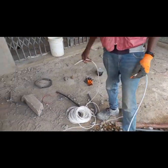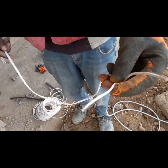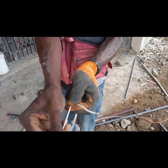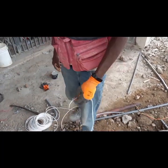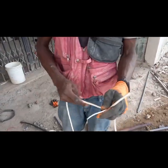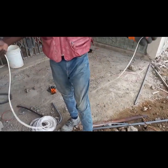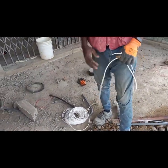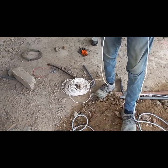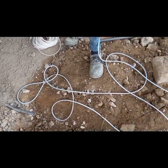It also comes in different sizes. Don't use the cable that was previously installed here — that cable will snap and break in no time. So we have to replace it with a 0.75 millimeter square coil flex. As electricians, we are guided by codes and regulations, and our main focus is always on safety.